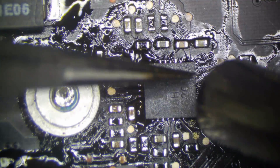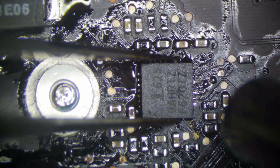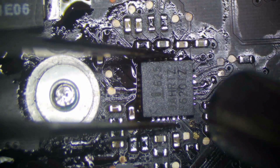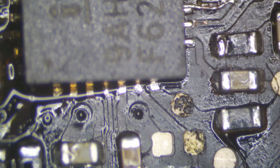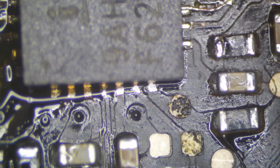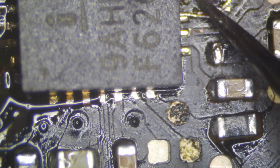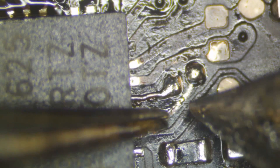It's always a pain to align the chip when you have wires under it — it really is, not fun — but there it is. We have our new ISL6259. I'm not going to push it down hard as long as all the pins are connected, we'll be okay. We do have to touch up right here because one pin came off. These pins are touching but I don't like them, so I'm going to resolve that. First things first, I'll get that little pin soldered back on that trace, then we'll conformal coat this with green conformal coating.